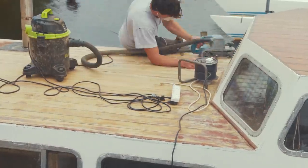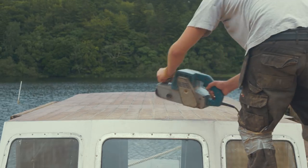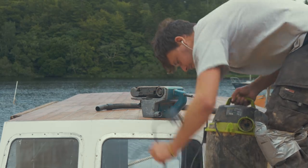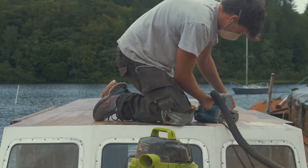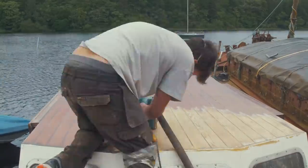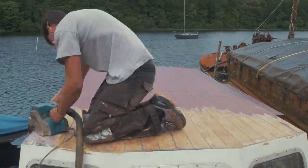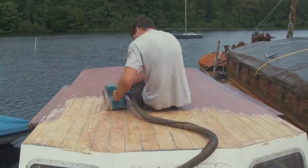If I was to first do the varnishing on the roof planking and then grout your grooves, grout your roof planking with Sikaflex or your sealant, that way it doesn't allow for anything to lift, and I think that would have prevented it from happening. You don't have your varnish over your Sikaflex, so it's not going to lift or peel while your wood moves and contracts with the climate, with the changes in the weather and in the temperature. That would obviously make it a bit more tricky when you have to do any upkeep with the Sikaflex, any repairs there.